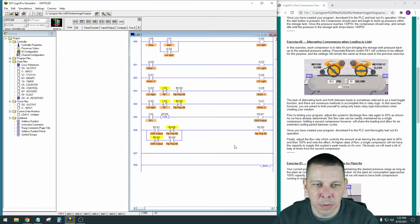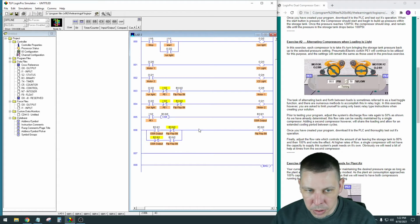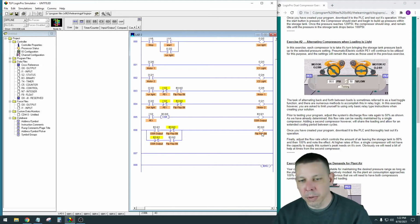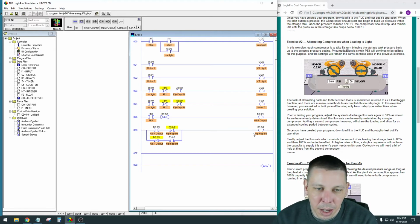So assuming all this is going to work first try without me checking anything in between as we're setting it up, the idea is this pressure switch is going to go from low to high, and that is going to make the one shot go from low to high or false to true, which is going to enable this B301, which these two are tied to. Whenever that fires, it's basically going to make this output the opposite of what it currently is. If it's currently high, when that fires, it's going to make this low or false. If it's currently false or off, or however you want to put it, a zero in this output memory location, it'll make it a one whenever that one shot fires. I'll go into why that is in the next video because it's kind of a long explanation.